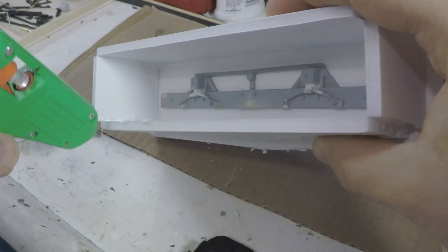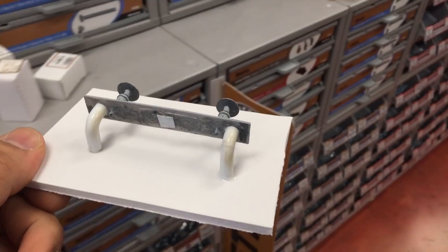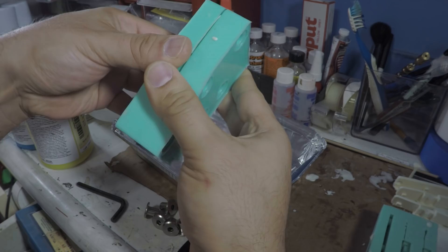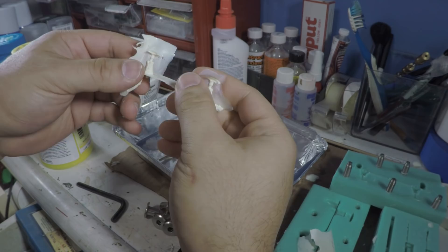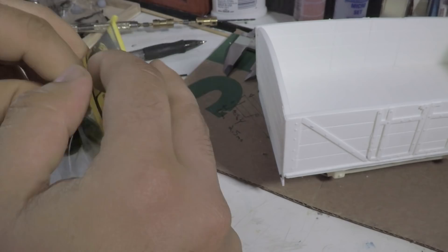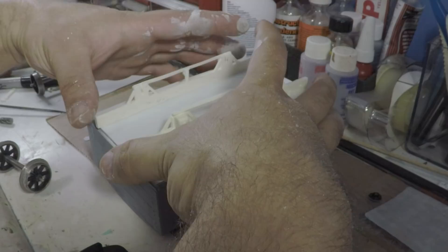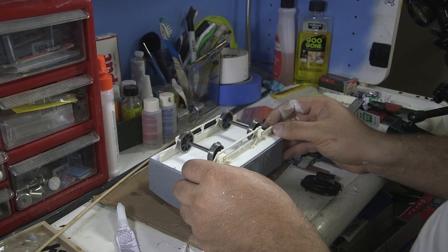In the meantime, I started building the buffer beams with the intention of making a two-piece mold. The two-piece mold went fine, but casting it was next to impossible without a pressure pot, and the thickness of the buffer beam just wasn't suitable anyway. Not to mention that the buffers are cheap enough to buy new, and cheaper than actually making the resin cast. The first wagon was an interesting introduction to getting everything right. Since the side frames are one-piece casts, there's no indication where the axle holes must be drilled. By the second wagon, I had this perfected.